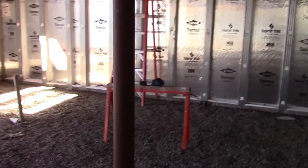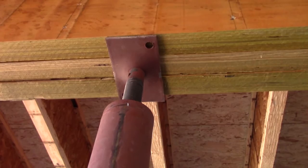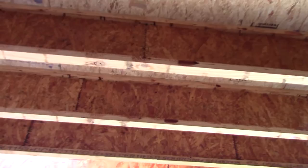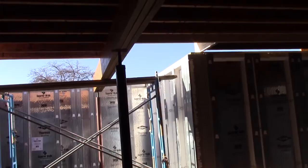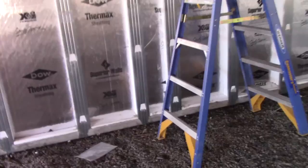We're not completely done down here yet because these columns are not fully bearing yet, and obviously there's no fasteners to the LVL — the main lam beam. We got part of the subfloor on too, you can see there. We have a scaffold here that's just kind of holding up part of the weight of the beam right now, although most of it's on these posts. We're off center a little bit here, so we need to fix that before we actually get it fully bearing, and we probably won't do that until after we get the full floor system done and make any fine adjustments.